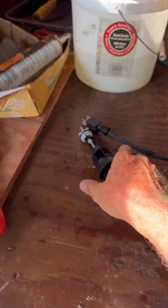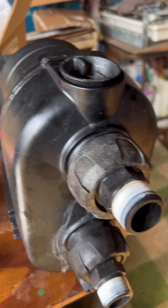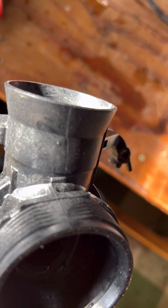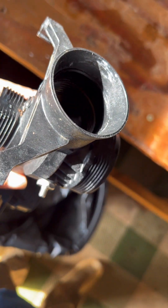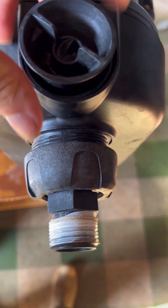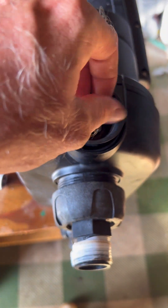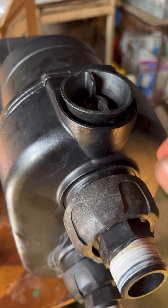Turn that, and then our primer goes on there. This one had a hairline crack right there and the water was streaming out of that when it was coming up to pressure. I think it was just the fact that this top plug got over-tightened. There shouldn't really be any thread tape on this — you only need it to be hand tight. There is a gasket on here, so just make it hand tight; you don't really need to wrench on it with pliers or anything. That's probably what had happened — it just got over-tightened.